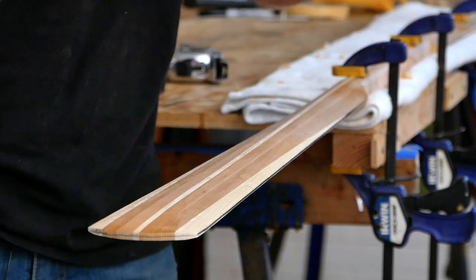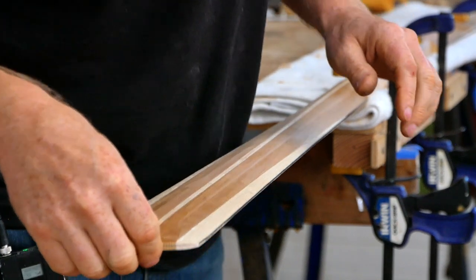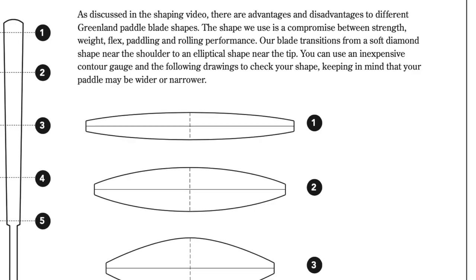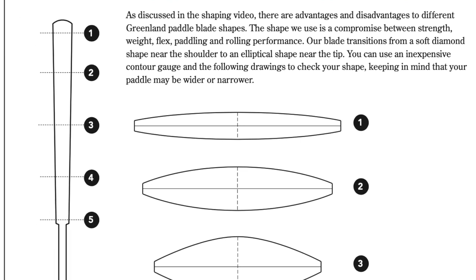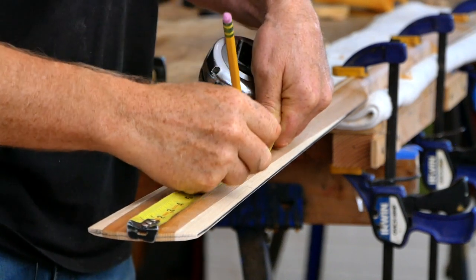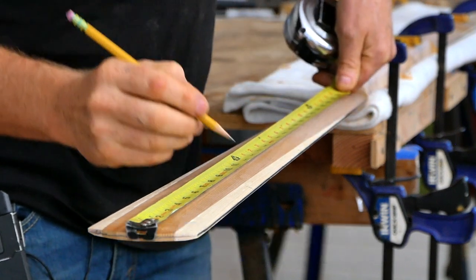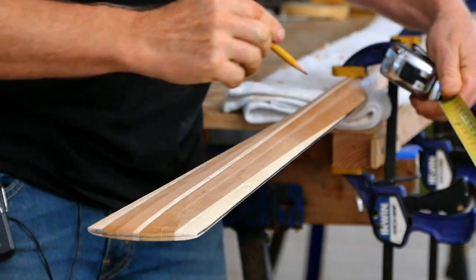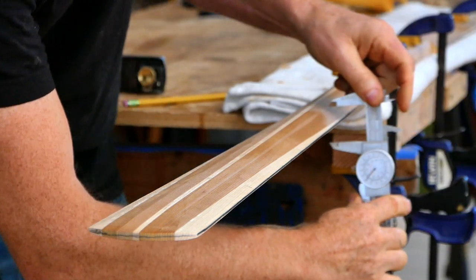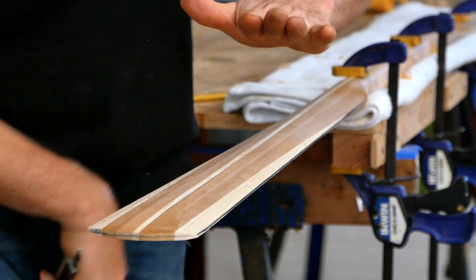How you approach this depends on whether you're working from paddle plans or doing this by eye. If you're doing it by eye, check the flex first and then start modifying by thinning out the blade if needed. If you're working from my paddle plans, I have detailed drawings for stations along the length showing the thickness of the blade at various points. At this point grab your tape measure and mark 25% of the way down the blade, halfway down, and three-quarters of the way down — put these marks on the outside edge so you don't immediately plane them off. Then grab your dial caliper or a combination square, measure the thickness at these points, compare to the paddle plan drawings, and thin out the blade down the center on both sides evenly as needed.